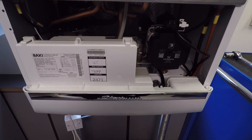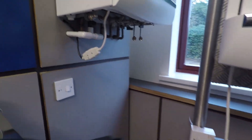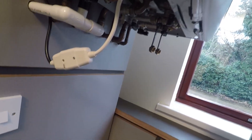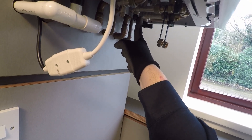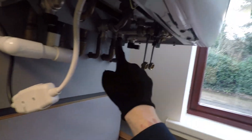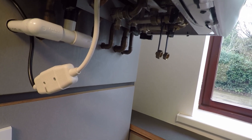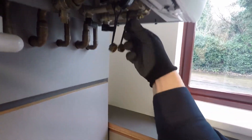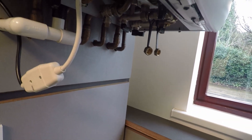As mentioned previously, we isolate the cold mains first. I can't emphasize it enough — please make sure that your hot and cold aren't crossed over. Cold mains off; if you've got an integral filling loop, open it up and you do not want to see the pressure rising or hear water going past, because if you do, it mostly means it is crossed over. Make sure you know 100% that turning the cold mains off has isolated the water to the boiler.